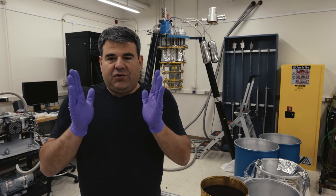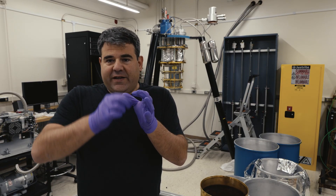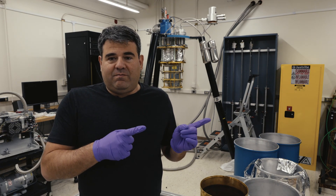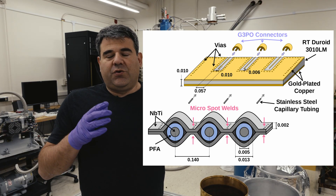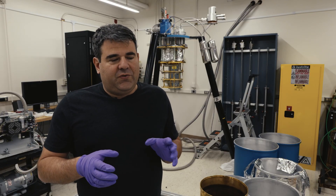It essentially involves two sheets of niobium titanium foil that are crimped into round shapes, and then a wire with Teflon insulation that runs through it. We actually built these and published them — you can see a picture of what they actually look like. These work well, and there's actually a company called Maybell Quantum that's commercializing these cables for other people to use.